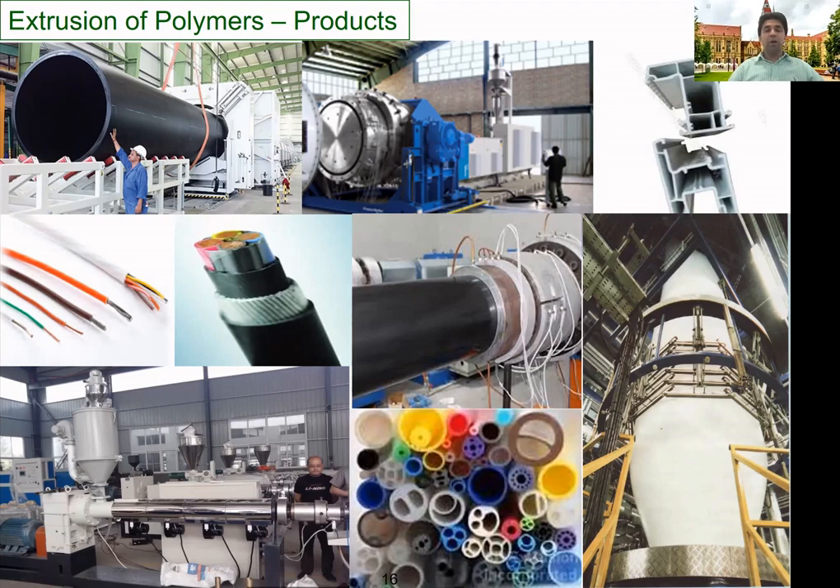In this slide, you can see some products manufactured using extrusion. You can see how large these machines can be — products could be a few meters in diameter and 5–6 centimeters in thickness. For a machine of that scale, you need to provide hundreds of kilograms of material per minute to produce large pipes. You can also see metal wires with polymer coating, multiple wires with a common coating, and other electrical wire examples with multiple different layers — all made using extrusion.